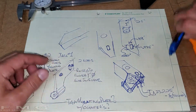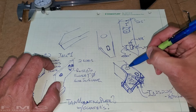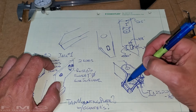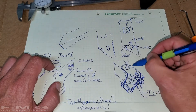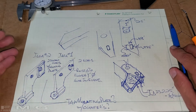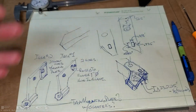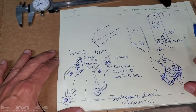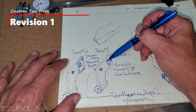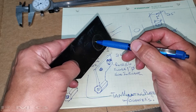Moving forward, I tried to make a 3D view. This is a plate that we would mount through those two holes, and it would come out and then we would weld this nut on the side of it. This dimension from here to the outside is four inches. I picked that number because McMaster-Carr had some steel stock that's four inches wide, so we can use that as our material at three-eighths inch thickness. Now I need to figure out how we mount it. This picture here shows a little boss on the bottom of our plate that would hook into that one-inch hole.